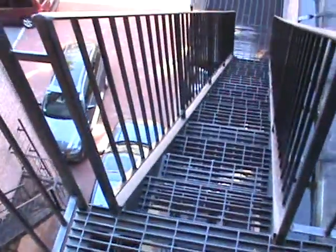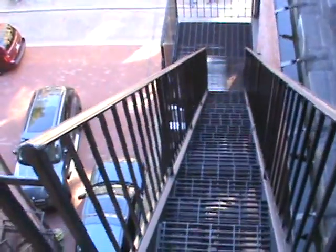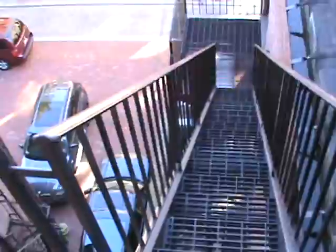Engineers inspect the summary video. We're here in Boston and we have a fire escape that is being examined to determine whether it can be certified and/or tested at this time as per Mass Building Code 1001.3. At this time the fire escape has a few issues, which I will talk about in detail now on the video, that are welding related and connection related. Once those matters are resolved, we can either issue an affidavit with a disclaimer, or we can proceed to a load test if that's what they wish to do at this time with this fire escape.